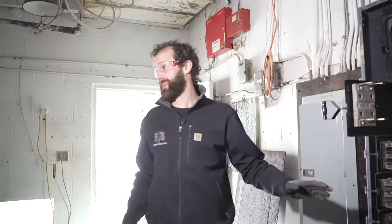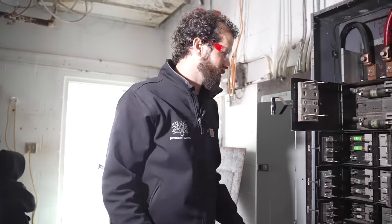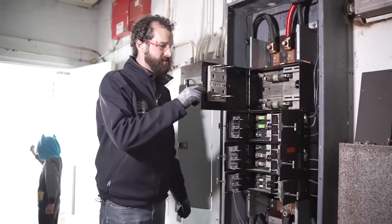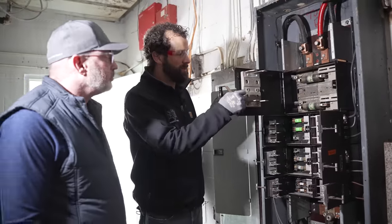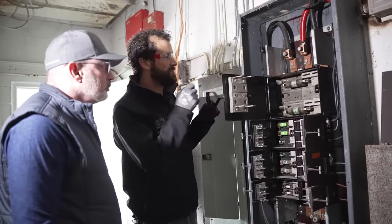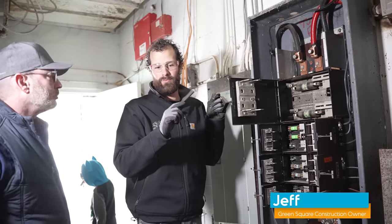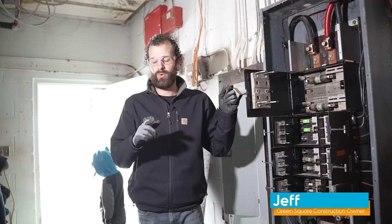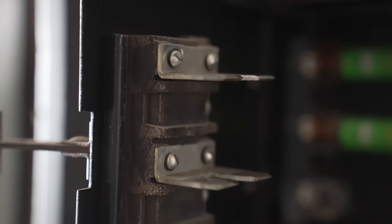It actually looks really good, even though it's as old as dirt. I'm just gonna go through and check everything, but on these copper connections here, they almost look like they're wire brushed. Look, it's like pure. So the press fit is nice and tight. The fact that it's fuses, not breakers, is good because breakers suffer more in a damp environment. Fuses are just bulletproof, very reliable.